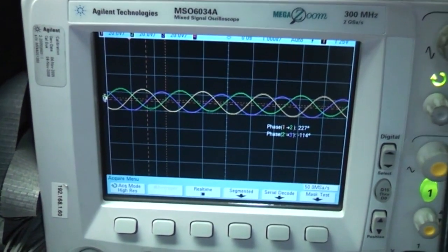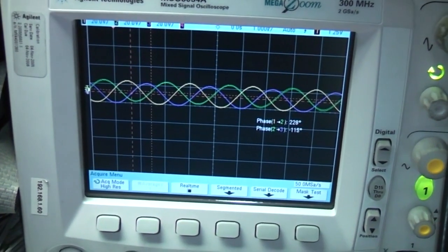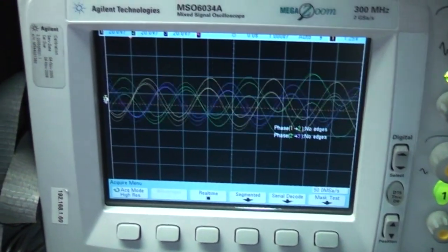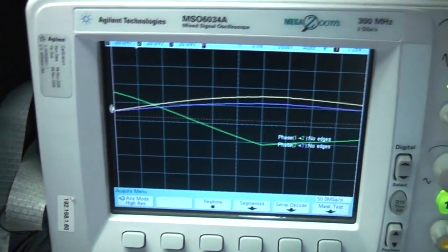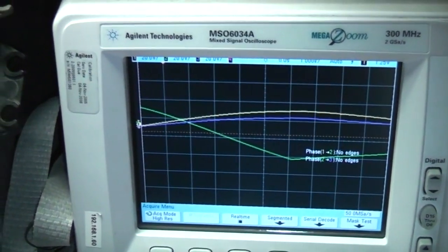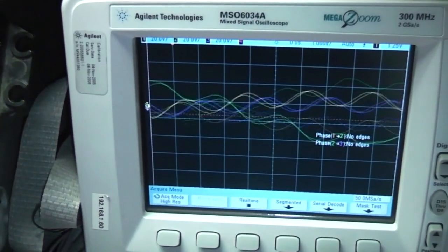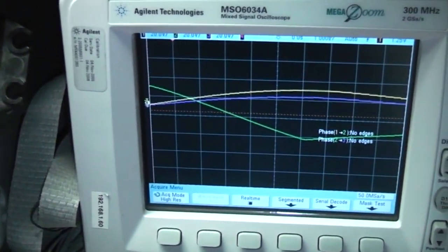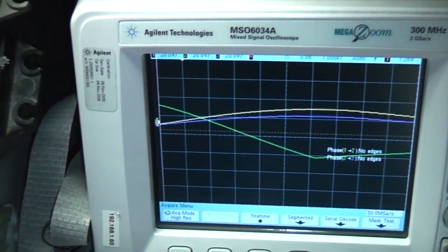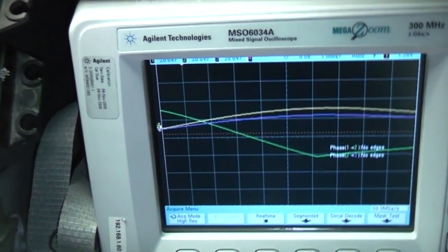And one of these amplifiers is a little bit touchy. It doesn't really like the inductive load very much. If I turn it up too much, it starts going unstable like that. That's not uncommon when you try and drive strange loads with amplifiers. They can do odd things, and that can sometimes result in the smoke coming out. But this one, I think, will just about tolerate running this thing.